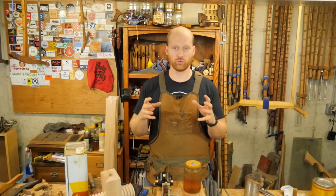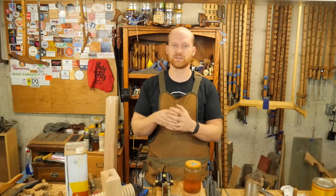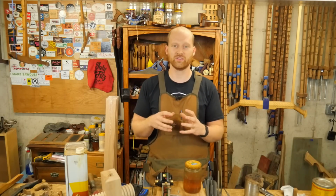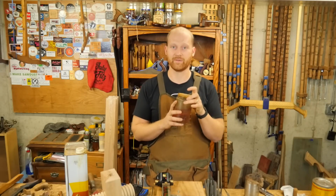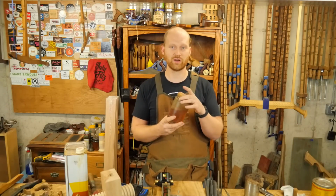But yes, if you wad up paper towels, if the wadding is loose enough that air can get to a lot more surfaces, the polymerization will happen and it will release heat. And if that heat builds up to the point where this can then combust, it will catch on fire. And I have seen it happen on 2 different occasions, once on purpose and once not. So yes, you do have to be careful.